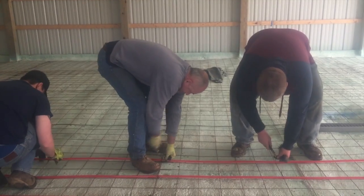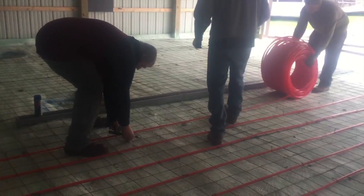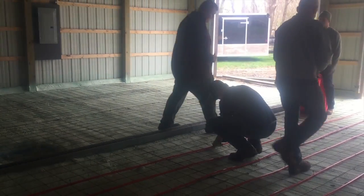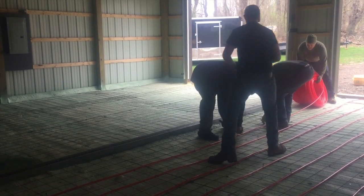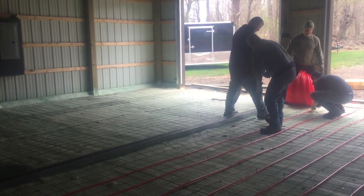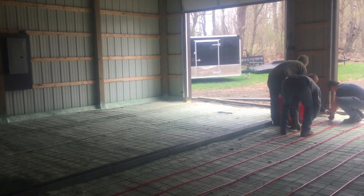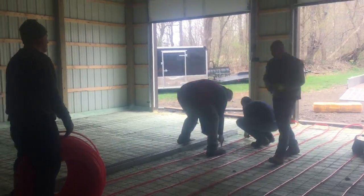The more people you have to tie this down the better. It is hard on the back, and a lot of times we're rolling tubing the day before we pour concrete. I've done it with just one or two guys and it really sucks being bent over tying all those ties. If you can get a couple of young guys to help, that's usually what we do — I got my son and another guy helping. You need those little twisty tools; you can buy them right at Lowe's and it goes pretty good.